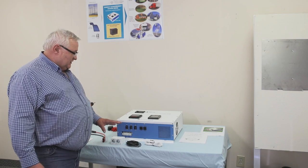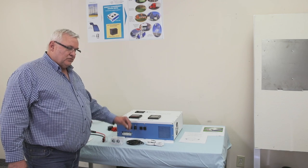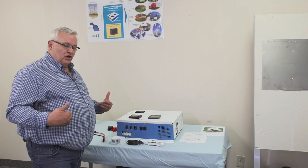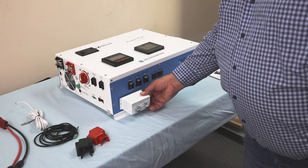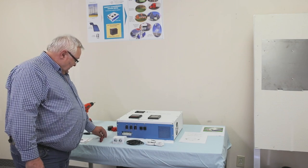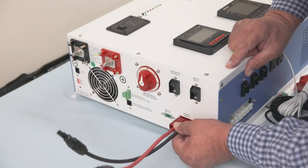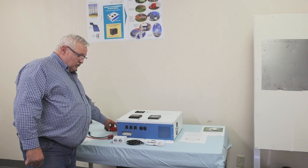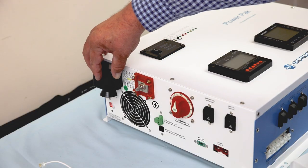It also comes with some extra pieces. You get two temperature sensors — one for the inverter and one for the charge controller. In a cold environment the batteries get cold, the unit knows that and adjusts the charging curve accordingly. It has a protection box which the electrical code requires you put over top after you wire up the AC input and output. The solar input has the typical MC4 connectors and an Anderson connector which plugs into our box, making it easy not to damage the connector. There are also two cover plates which go over the battery terminals once the battery cables have been mounted for safety.